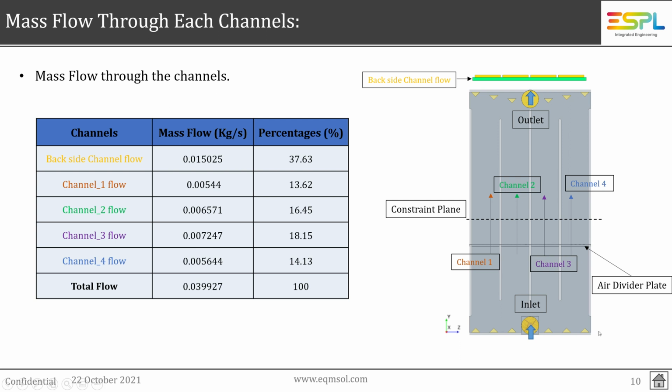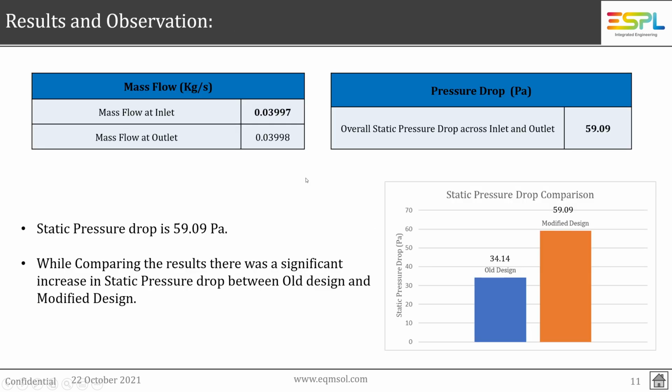So basically in this simulation you had 4 restrictions for the air that goes on the visible side channels, and that is causing some problems. That's why I will probably change a little bit of that for the next simulation so it can go more freely before the baffle plate. There is some more pressure drop than in the last design. Maybe some is explained by the fan and also the restriction plate there.